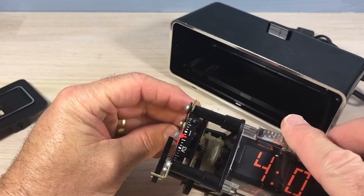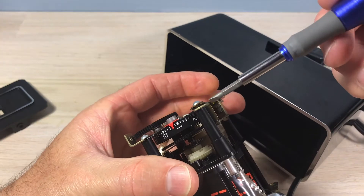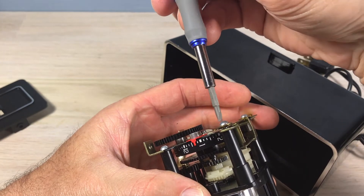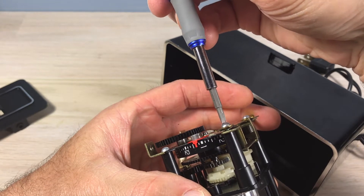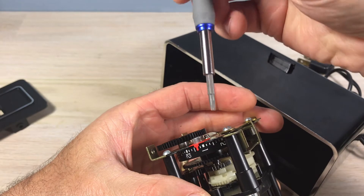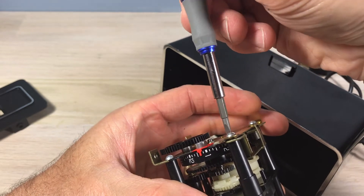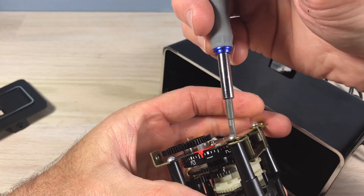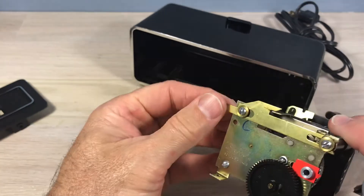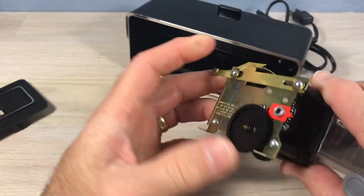This thing here is pretty simple. You can see that this slider bar is actually underneath a washer-type thing — sort of like a bushing. There's an indentation that this bar is going to slide over top of, and it had gotten underneath it. So now you can see that it slides just fine. Pretty simple fix.